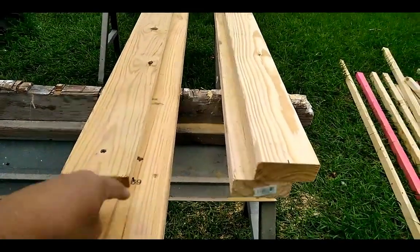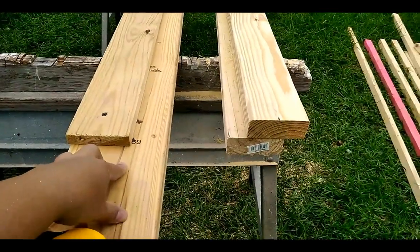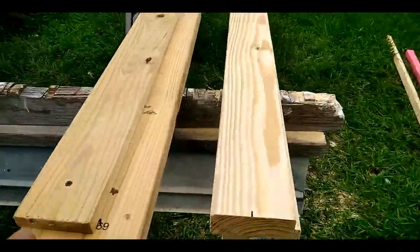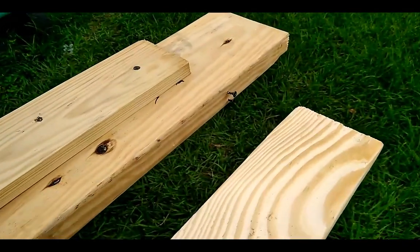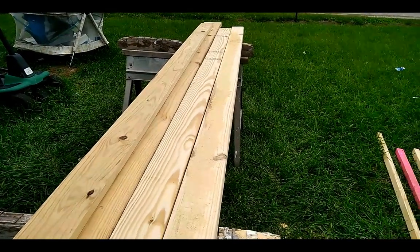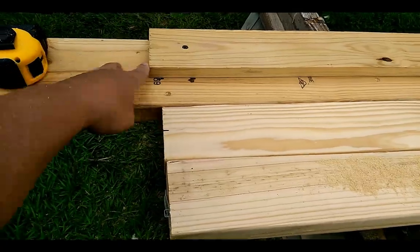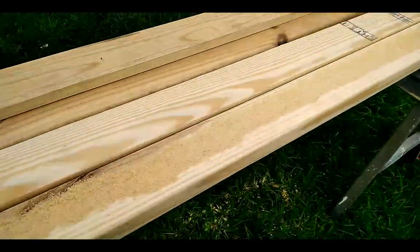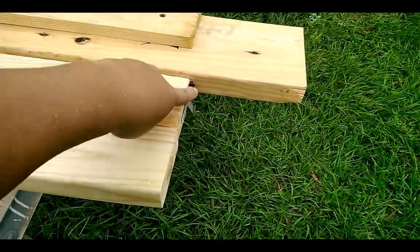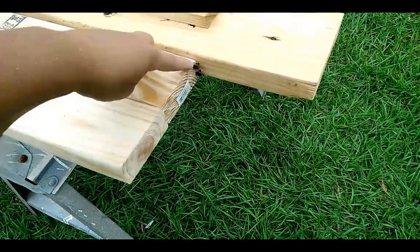Now you'll see that I have my 1x4 screwed down to the 2x6. I'm going to set the 2x4 in there. Because you're going to be cutting a long piece of wood, when you stick the 2x4 in here it can slide when you're trying to cut it. So I made some little stops down on the 2x6 — when you stick the 2x4 in there, you slide it until it hits the stops, and you want it to be about where the end of your other 2x4 is. Also make sure when you put these in that you screw them far enough in so that when your blade comes down the middle of the 2x4 it doesn't hit those screws.